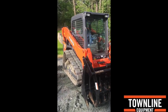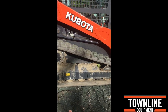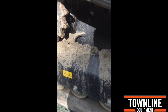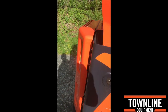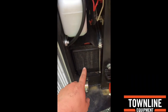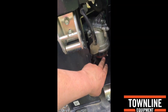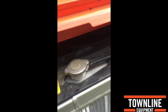As we do our walk-around on the SVL 75, we can start with their carriage system. This has a grease tensioner which does your track tension. You've got your idler wheels on the bottom and your rear sprocket to power. The back of the SVL is a single latch door. Your battery is on the right side, the cooler on the back, and a water separator with fuel filter right behind it.